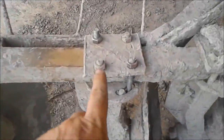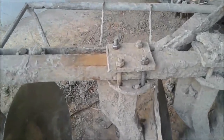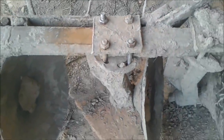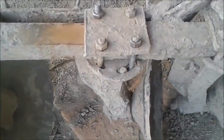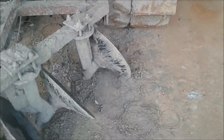I have been tightening up the plate quite a few times but it just works its way loose. It doesn't fit quite square on there — I think it's just the way they've drilled the plates, it doesn't quite marry up. So I'm going to move that one to the left a little bit to even it up, and I'd like to bring this up here just to bring the plowing width out a little bit.